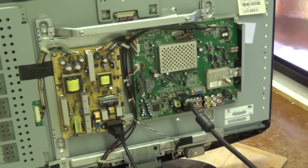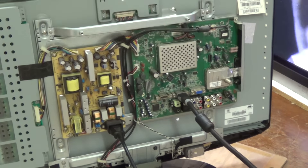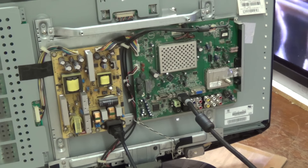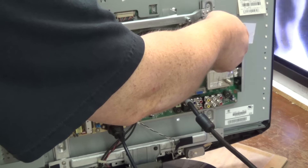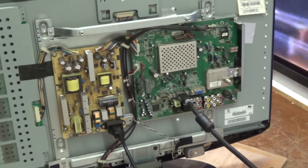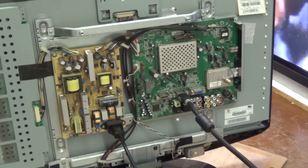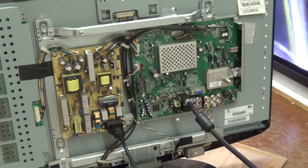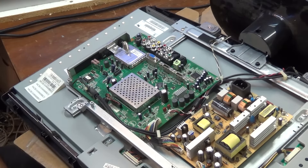Again, if I unplug — this is where the plug goes in up top here — if I unplug it, it stays on whatever mode it's in; it doesn't advance. But the on-screen display doesn't go off either. So I guess we need to look at the board here and see if there's anything. I'm told nothing was spilled on it, but you know how people are — maybe something got spilled or something's on here causing leakage. Let's take a look at the board. It's not worth spending a lot of time on it, but it will be interesting to see what's causing this problem. Any fault on this is likely going to be on the main signal board.